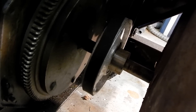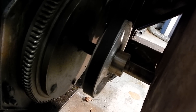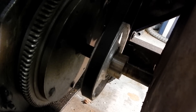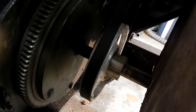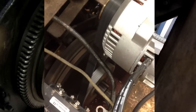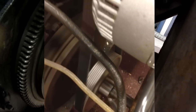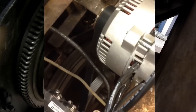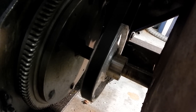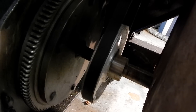What I ended up doing was casting one out of aluminum, and that was a saga in and of itself — I'm making a whole other video on that. But that is a 3D-printed, lost-PLA cast aluminum pulley with a machined steel insert in the center to mount it to the shaft. As you can see, it runs true. It took me like four tries to perfect this process, but now I'm really pleased that I'm able to make fairly precise parts, 3D-print them, and then cast them in aluminum.